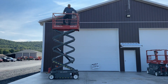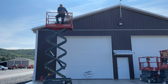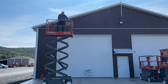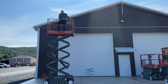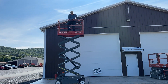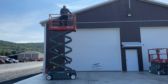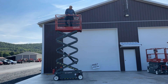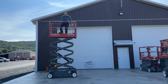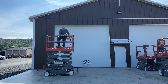A little educational thing on these Skyjacks — these are a very simple lift. They are a 24 volt system, very simple to troubleshoot. There is not really a computer box on these per se, like a lot of lifts. So you can work on this thing yourself. You can see we can drive while we're up in the air, which tells you the pothole protector sensors are working. If you ever have one of these that won't drive up in the air, your pothole protectors are stuck, not allowing the sensor to move to the position it needs to be to allow you to drive. A little fun fact tip of the day.